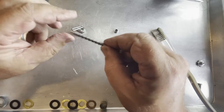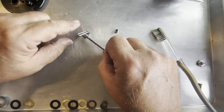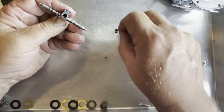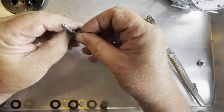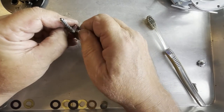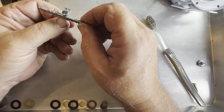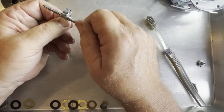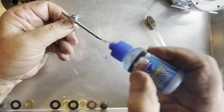With the worm gear you've got a flat-sided area and an inset - that's going to fit, if you set your carrier assembly down like this, going over to your left because that's going to fit into this side plate right over here. Once you've got it in there, flip it over, take your pawl and set your pawl down inside the pawl carrier, slip it in, and start to screw it down. Once you feel it begin to make impact, start to try to turn it. Once it goes in good it'll drop down more and you can screw it in more. Go ahead and oil your worm gear.